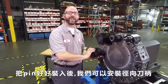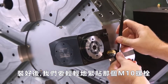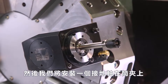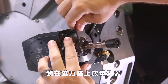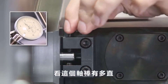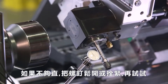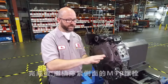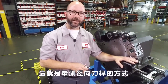With our pin properly installed, we can mount our radial tool holder and align it. After it's mounted, we're gonna snug just lightly that M10 bolt. We'll then mount a ground shaft into our collet — I'm using an extension, but you can use a dowel pin or even a tool. From here, I'm gonna take an indicator on a mag base and indicate along the side of that ground shaft, seeing how straight this holder is. If it's not already straight, we can loosen and tighten these set screws against that 10-millimeter pin. Once you've gotten it straight, lightly tighten both set screws against the pin. Then go ahead and finish tightening that M10 bolt on the side. That's how we align our radial tool holders.